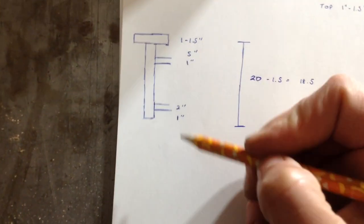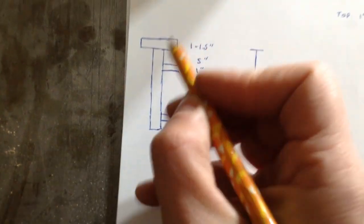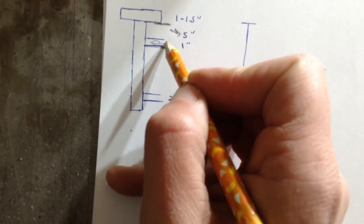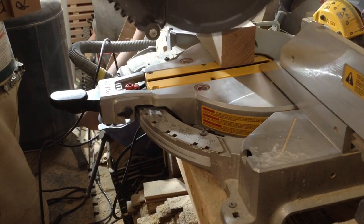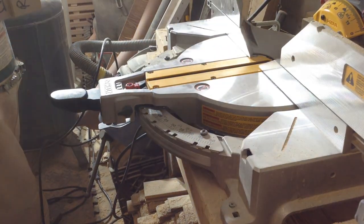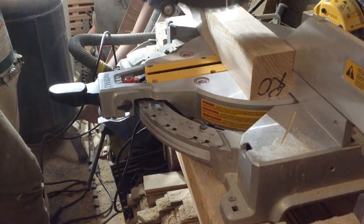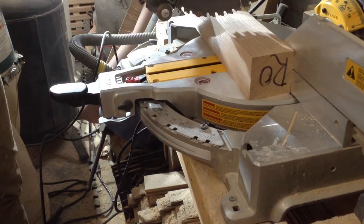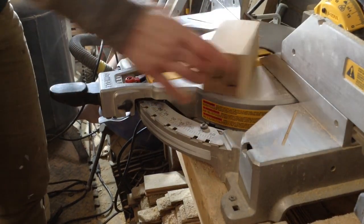On a big build like this I had a couple other projects going on at the same time, so if I could save myself an afternoon's worth of shop labor planing them it equals out to the added cost. This had a pretty specific height and it's also going to have lifts, so I had all the calculations planned for how wide the aprons had to be for the clearances for all the hardware going inside the cabinet. The legs were about 18 and a half inches tall and my top rails were going to be about four and a half inches.